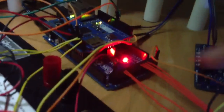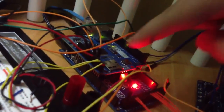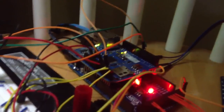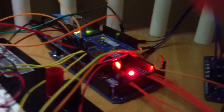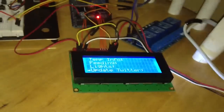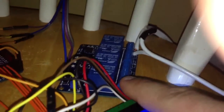Here's the actual setup. Here is the Arduino Mega right here. Connected to that is an ethernet shield which lets me connect it to the internet. It sends Twitter updates every 10 minutes so I can monitor the aquarium temperatures when I'm away from home. Here is the LCD screen attached to it — it has its own built-in menu which I'll show you in a second. Here is the power relay which controls the aquarium lights.